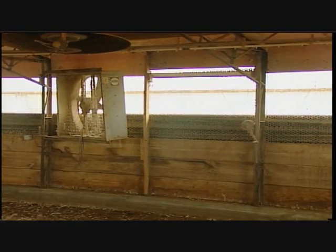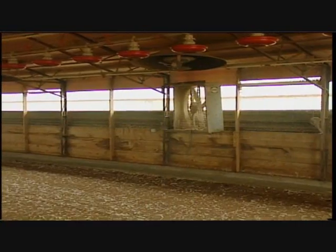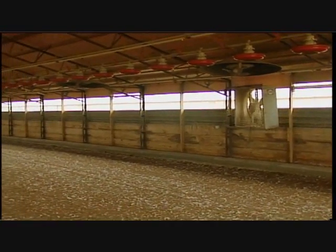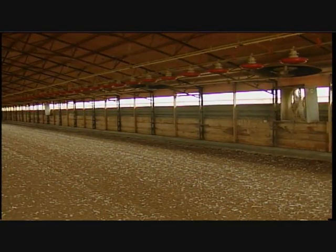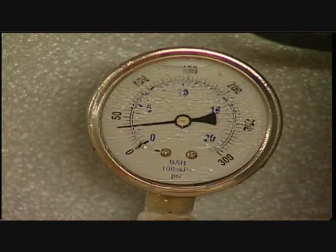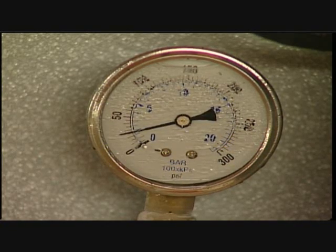If it is windy or gusty, raise the wind side curtains most of the way up. You can leave the other side down. Keep the door ends open. Airflow is critical to proper operation. On houses with low side walls, lower the operating pressure to 25 psi when flaming next to the wall. 2 passes may be required. The same applies if the entire ceiling is low.